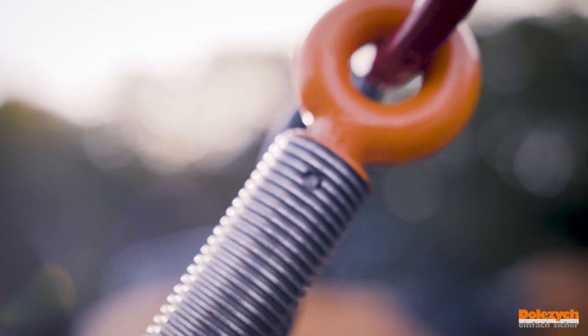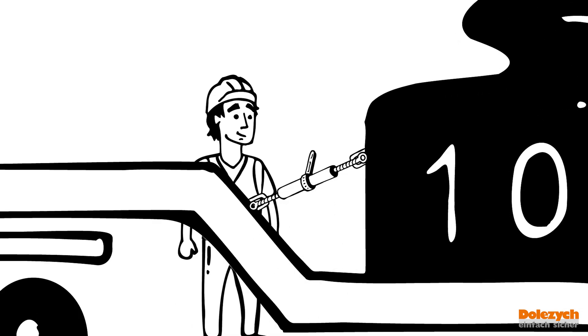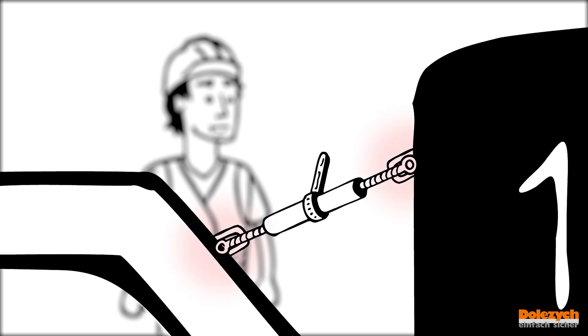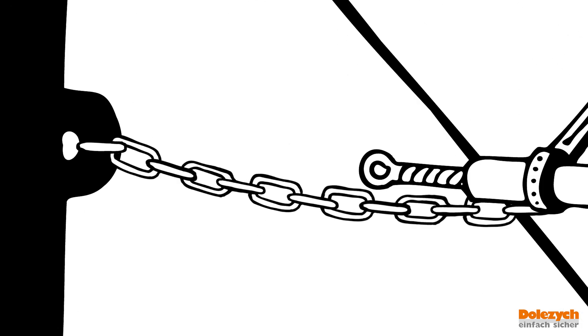This is because, in daily use, there are always these difficulties with direct lashing. The design of a load binder is often too large because there is little space between the load and the vehicle for lashing. Or its tensioning distance is so small that a great deal of force is required to tighten the lashing chains when they are hooked in.